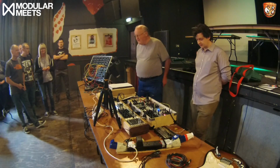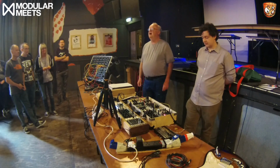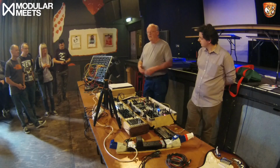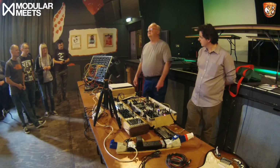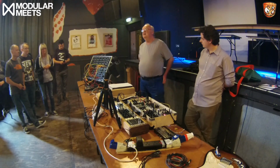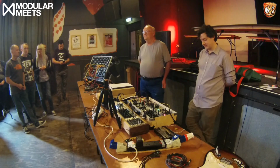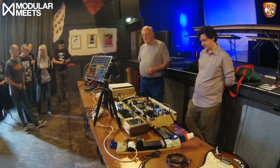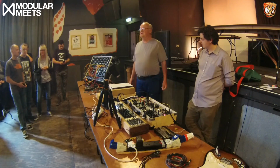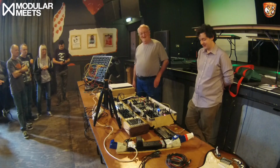And then there's the monitoring section, the envelope detector. This is an RMS level detector with a logarithmic output, and so you've got an envelope follower and both a positive and a negative one, and a gate and trigger extractor, which pick out the beginnings of notes, and that's to drive an ADSR. That took quite a bit of fiddling around with to get just right on picking out notes. So it will notice you can pick notes, you can hammer notes, or you can play chords and then play them again, and you get a trigger on that second one, and there should be no false re-triggering if I've done my job right. I'm quite pleased with the extractor.